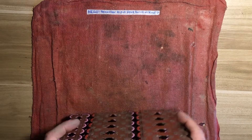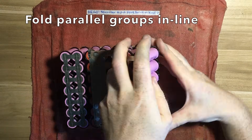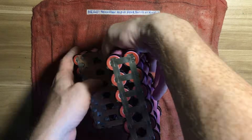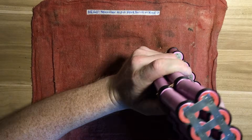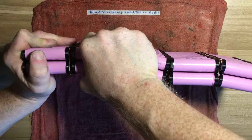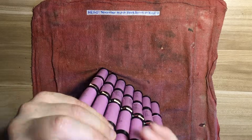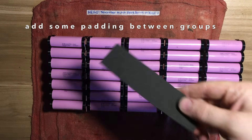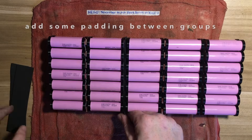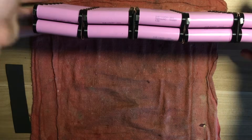Now we're going to fold these 5S groups in line so that we can stack them on top of one another to make the complete battery pack. I also added some heat resistant foam as padding between each parallel group to better align the module and also prevent the groups from knocking into one another when they're inside the pack.